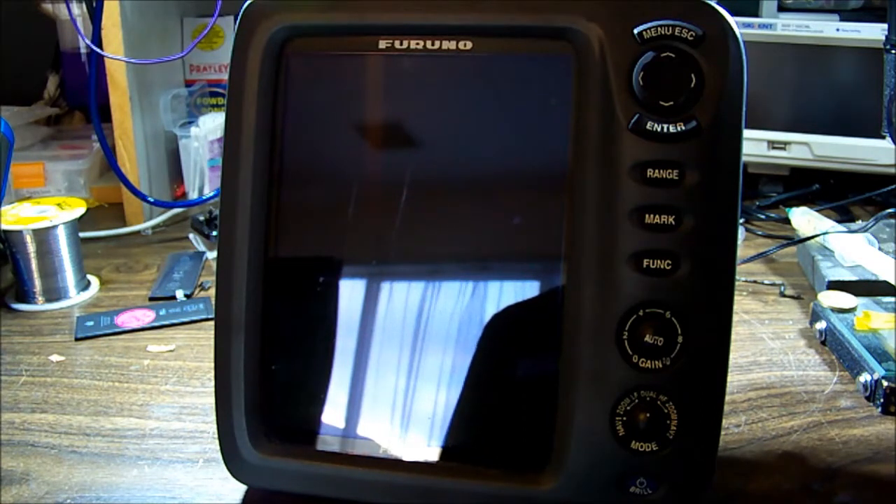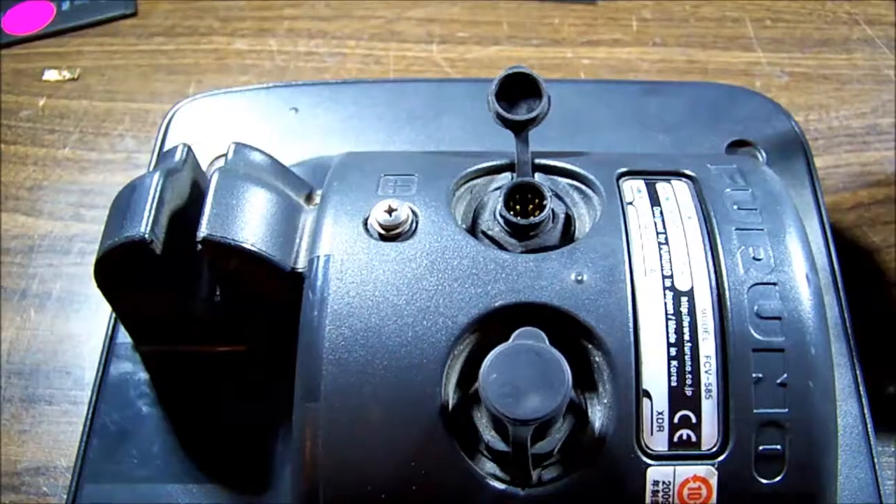This one encountered a low battery voltage and ever since, the backlight no longer comes on. We don't know if there's some sort of damage - the owner believes there was poor earthing in the electrical system. It briefly turns on, you get a bit of an image, very dark, and then it shuts down again. If it was a backlight-only fault, I'd expect it to stay on and just be dark, but it turns off.